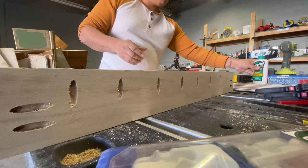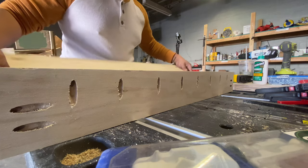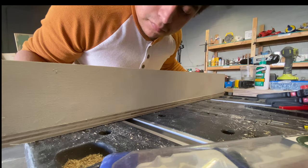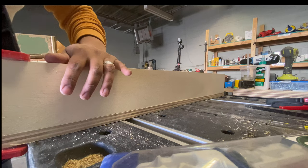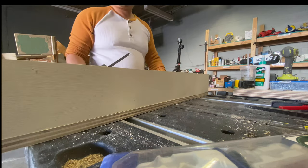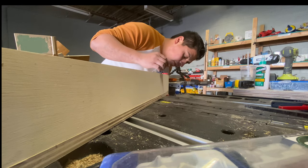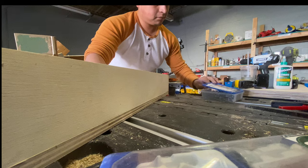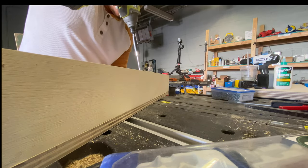I took some wood glue and joined the one-by-four piece with all the pocket holes and the top piece, then did it again with the other one-by-four piece and the bottom piece. I'm using one and a quarter inch Kreg pocket hole screws — the size you use depends on the width of the material. Since I was working with three-fourths inch plywood, I used one and a quarter inch screws so they wouldn't come out the other side.